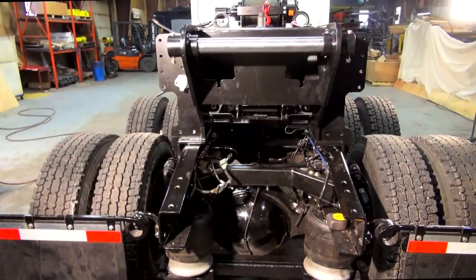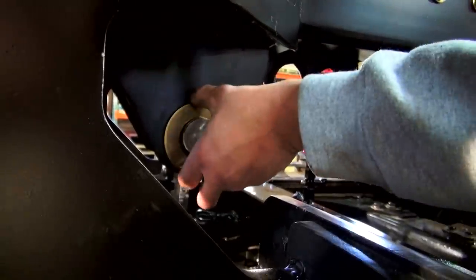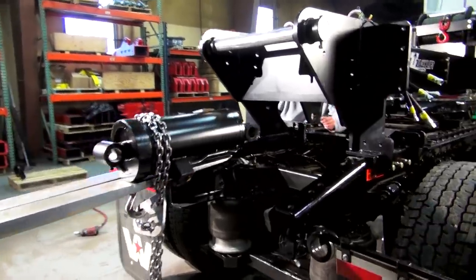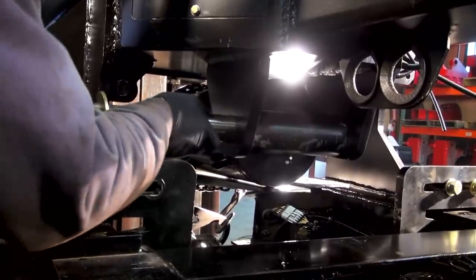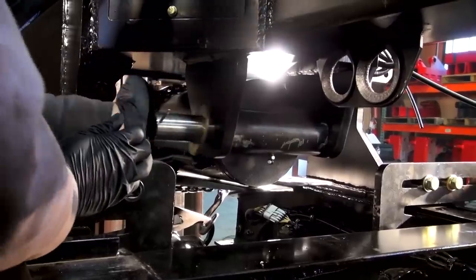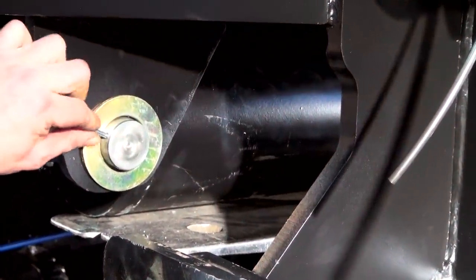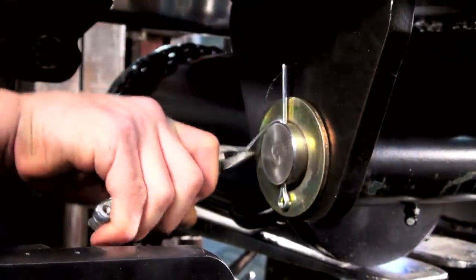Now your RTU is secured to the frame of your tractor. Next we'll be installing our lower tilt cylinder — it's best to do this before you have the ZAK-Lift in place. We start by removing the pin underneath the beam towards the rear of the tractor. We're using a forklift to position the tilt cylinder and line up the height before inserting our pin. This is a 403; on a 303 you'll have a step-down bushing on this pin itself. Once in place, put cotter keys through both sides and bend them to make sure the pin stays retained.